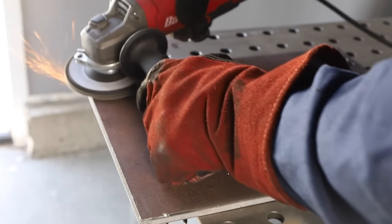The size of weld you need depends on a lot of factors — it's really an engineering decision — but as a general rule of thumb you want it to be at least three-quarters of the material thickness, or a minimum of around 3/16 of an inch. Why am I talking about weld sizes? Well, a larger electrode is going to deposit more weld. So if all we need is that 3/16 inch weld bead on something thinner like this 1/8 inch thick material, then that small electrode is going to be just fine. There's no reason to run a larger electrode on something like that.